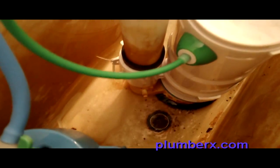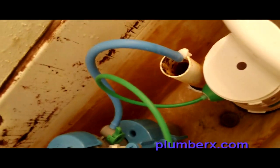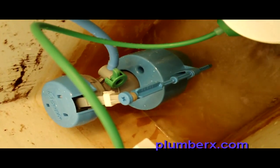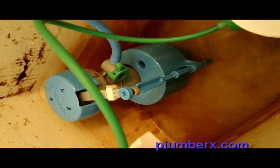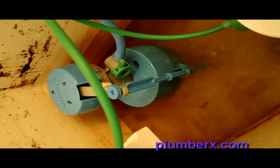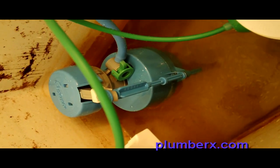And of course we're turning the water back on. Now you see the water coming in from the bottom of the fill valve. There's actually an optional additional part that will adapt to the bottom to help keep the tank clean by stirring the water up. You notice that as the water fills, the blue cylinder pushes up, and when it gets to a certain height it automatically cuts the water off.